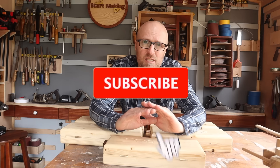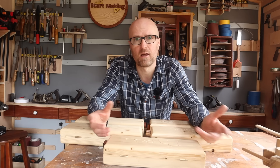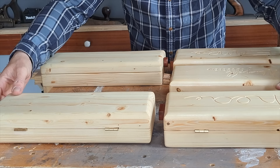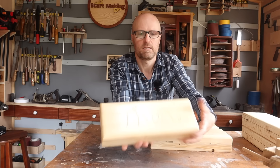I favour two different ways of finishing. First is the simplest, easiest and quickest — just spray lacquer. Or I go for a hard wax oil, something like Osmo Oil, where it takes a little bit longer because of a longer curing time, but it is so easy to apply. Both tend to amber the wood a little bit — the lacquer a bit more than the oil — and the lacquer will leave a sheen whereas the Osmo Oil tends to be a little bit flatter.